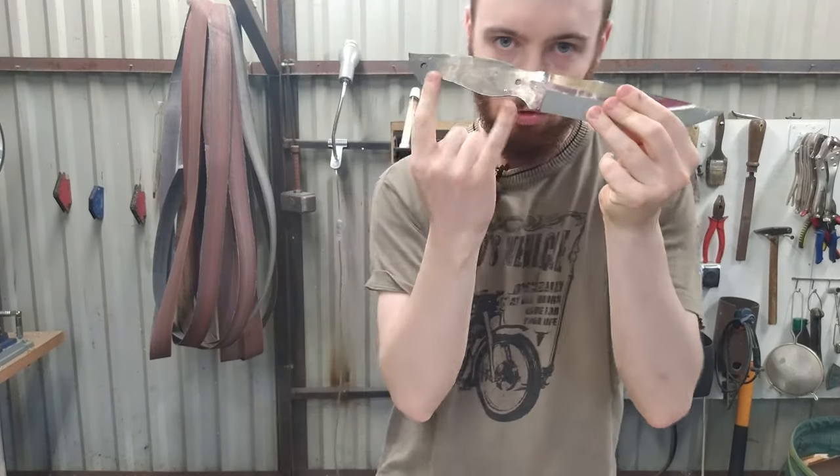I've annealed the handle, drilled two holes and created a bevel using 36 grit. Now I'm going to change belts to 240 and 400, but also I'm going to reduce speed each time to 50% of the previous speed. Question is why?